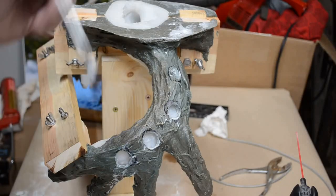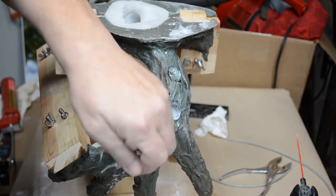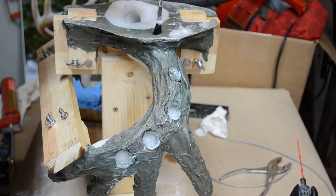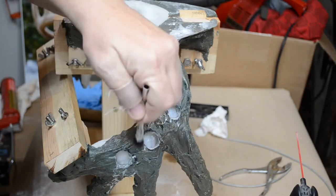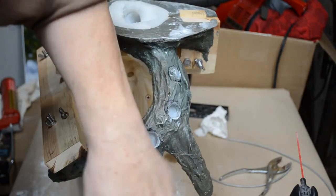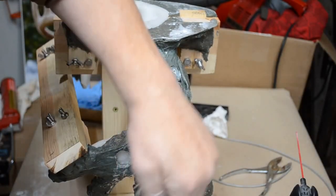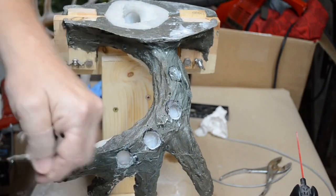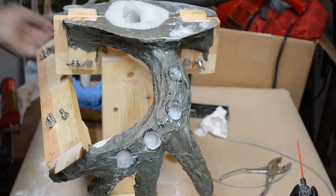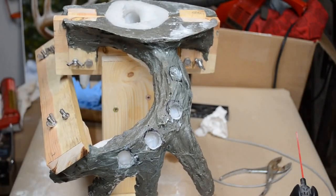Now after waxing the parts of the mold where resin leaked out before, it actually didn't leak out down here. It leaked out up at the top where the seam was uneven and ran down to the lowest point, which was here, and then poured out. So I'm going to make sure that these tines are covered. These lower tines are all covered. Well, they're upper tines when it's right side up, lower tines when it's upside down. I'm doing that on both sides. All right, now they've been covered with the sonite wax.